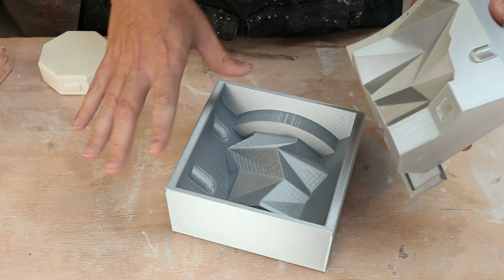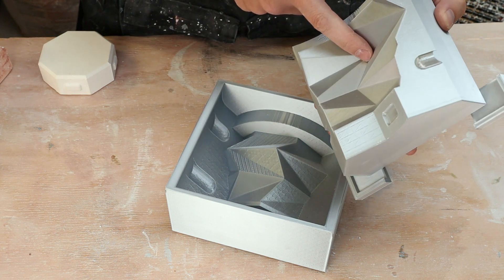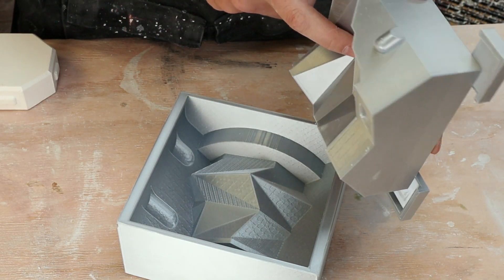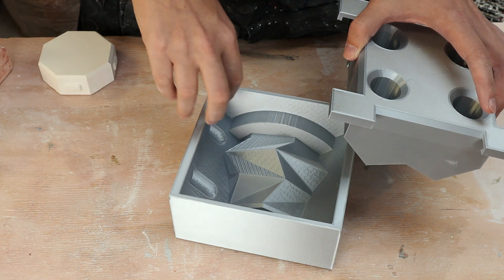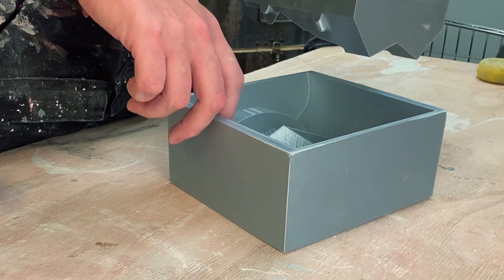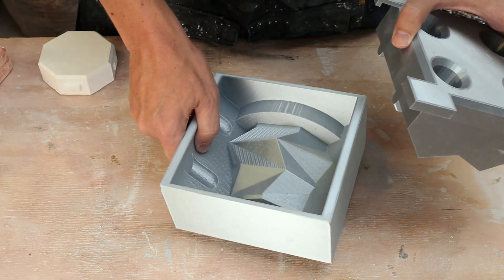It's going to be cast this way. I have two concerns with this mold. One is that air will get caught in here — bubbles will try to rise to the top and I don't know if I can get them all out. The other problem is the way I designed this — there's actually a negative draft angle here. That's to make the resulting plaster part nicer to handle, but it may cause some challenges. We'll see.